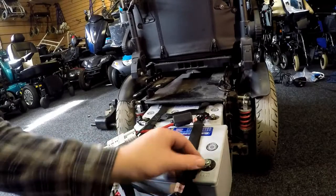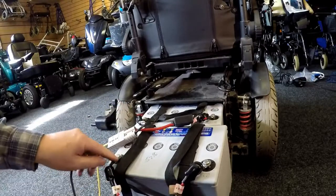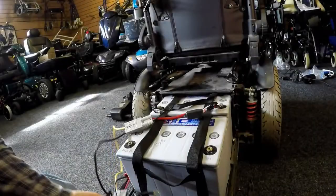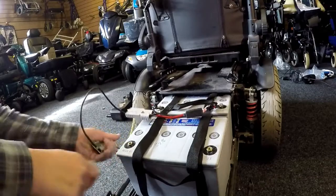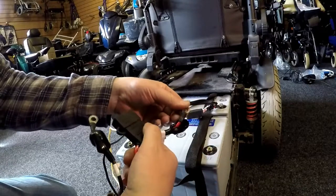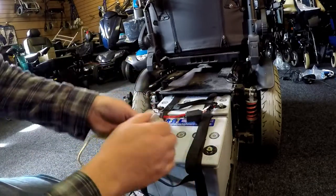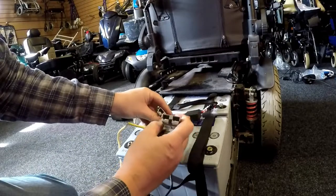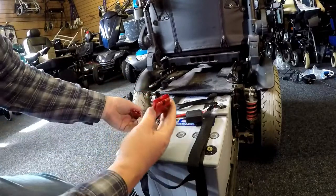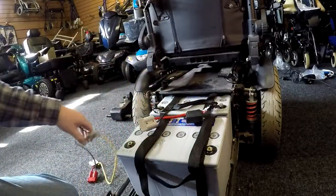Now that I've tested both batteries, there is a tiny bit of corrosion around some of these connections here. Let me take that off. We remove the battery terminals and check to see if any corrosion is present — no corrosion. Check the Anderson connectors — every single one — they're fine. We also want to check where it joins here, just to check that it's fine. Both of them are fine. The loom's okay. Could be a hairline fracture in there — it's a few years old. We know the fuse is working, but we'll check it anyway.